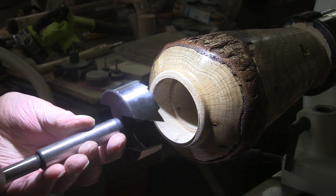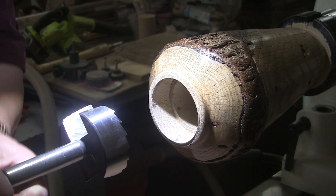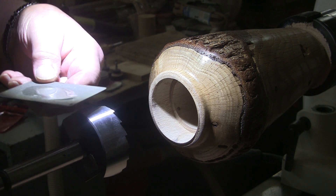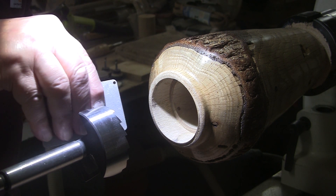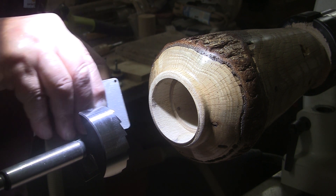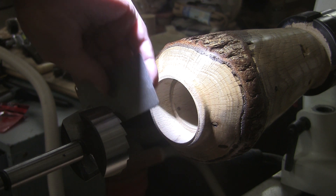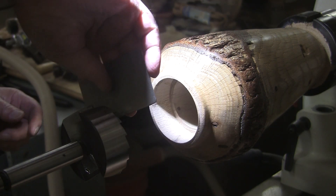The easiest way is to put it in the chuck. Get a place that's comfortable for you to use — for me that's right about there. Put a little honing oil on your diamond card. Doesn't take much, just a couple of drops. Spread it around. Just lay it flat on there and run it back and forth. And then when you're done, a couple of strokes this way — get it on that bevel, nice and flat on that bevel — and a couple of strokes that way. And you'll have sharpness here. You'll just be pleased at the outcome.